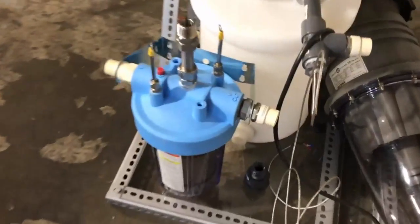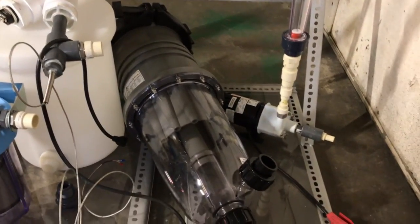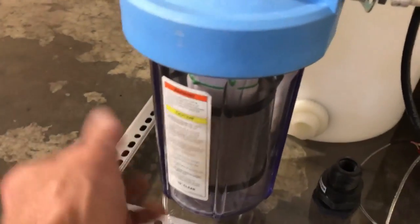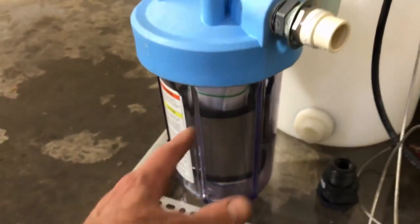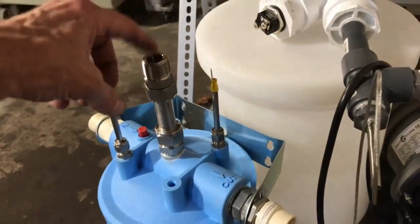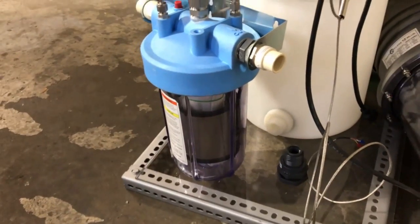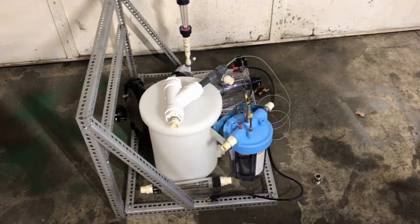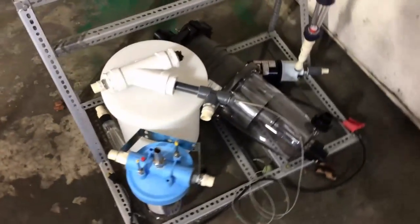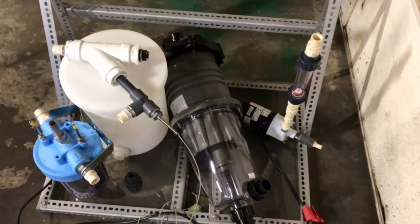We're going to be putting it inside of this bad boy right here — I'm just about to throw this thing together. I've got all the parts; the cyclone finally showed up, which by the way looked a lot smaller in the picture. This is an electrolysis cell with an anode basket that's going to be filled up with metal through this port right here, and it will be digested and plated out onto this plate into pure copper. This is the beginning of an electro-refining cell — just getting everything set up.